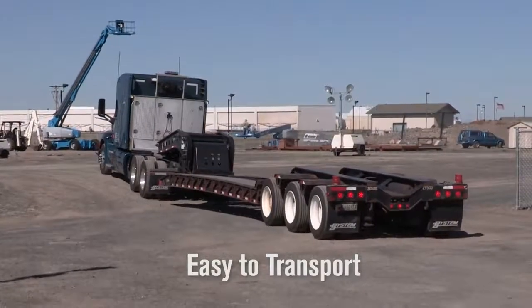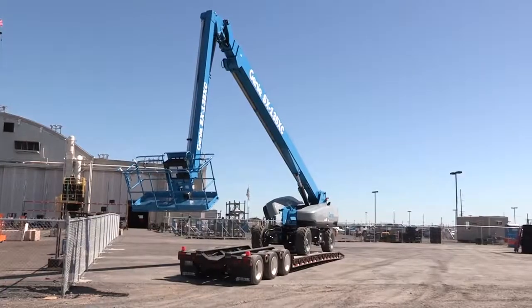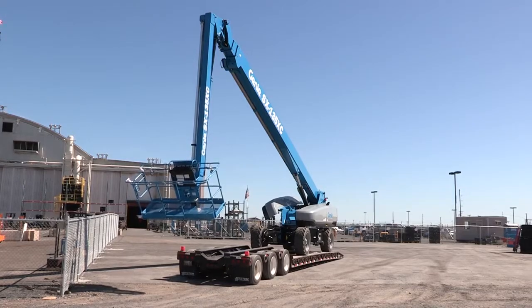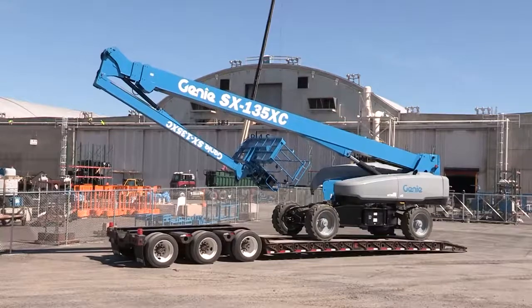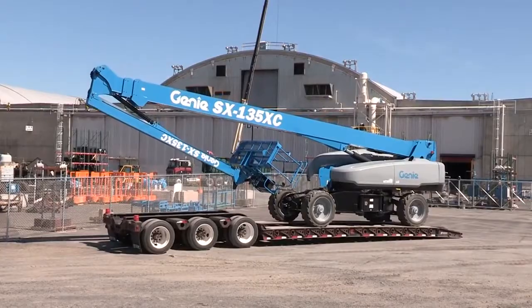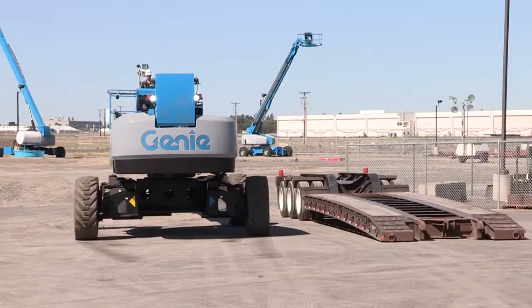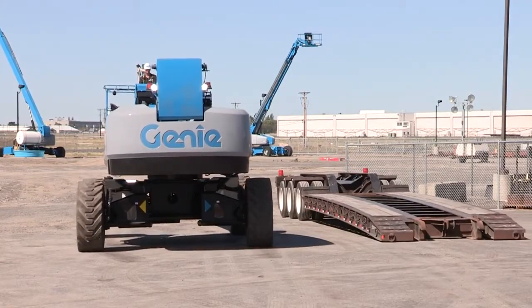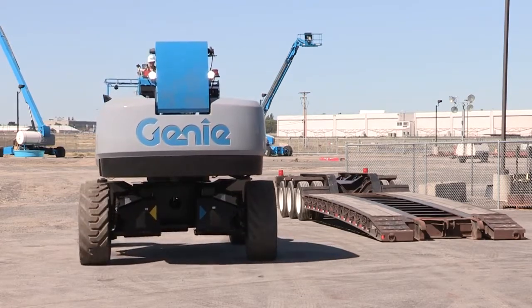Since this is a long machine, we needed to figure out how to make transportation as easy as possible. We've designed in a very high range of motion bell crank that enables us to raise the primary boom up and then tuck the jib and platform all the way under and then bring it back down for transport. This brings the transport length down to a comfortable 43 feet 7 inches. The footprint when expanded is 12 feet 11 inches and it collapses down to 8 feet 2 inches, letting you transport on a standard truck without being overwidth.